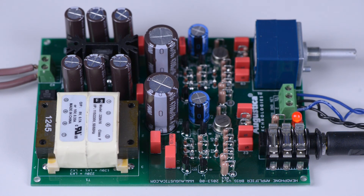The power supply unit has two buses — a negative bus and a positive bus. Each bus produces 12V DC, and each bus has a voltage regulator responsible for regulating and stabilizing the DC voltage. The positive bus uses an LM317 voltage regulator and the negative bus uses an LM337. Around the voltage regulators you can see six large 1000uF capacitors which are responsible for smoothing the DC voltage produced by the power supply unit.